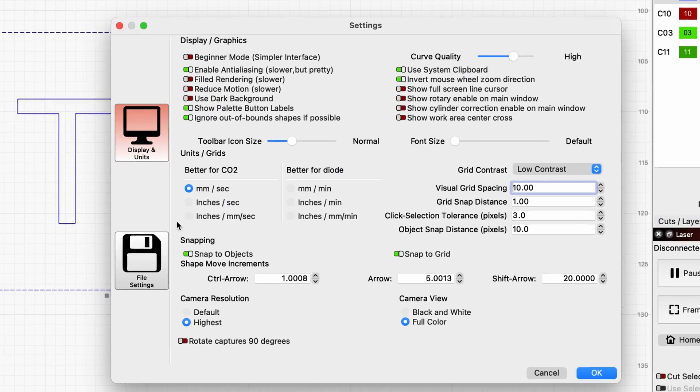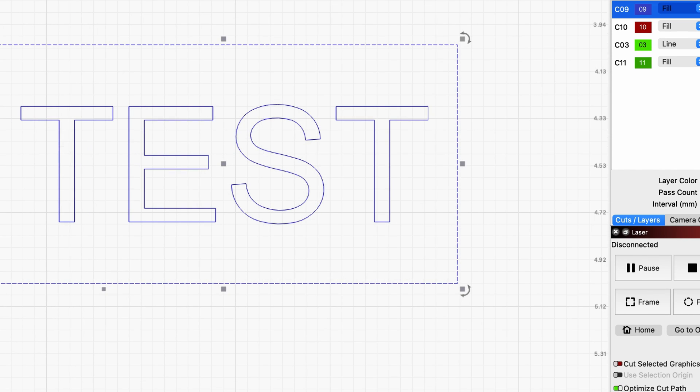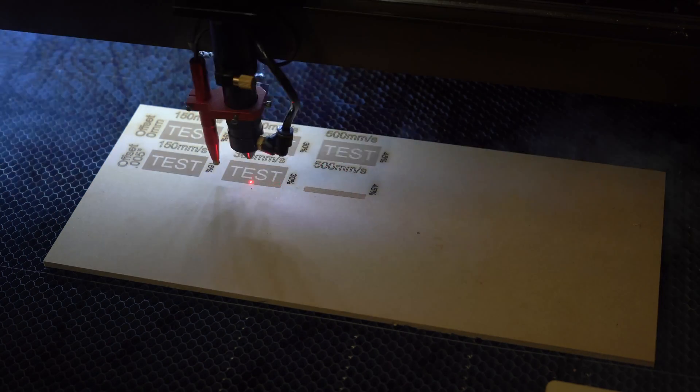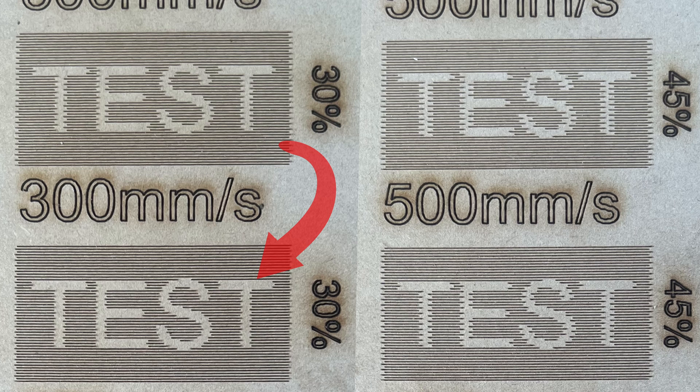We're trying to tell the laser to start or stop with better precision so we can make sure we hit our mark. Make sure you note whether your system is set up for imperial or metric and make incremental changes based on those settings. Since I'm already in imperial, I'm going to use that to make my adjustments — remember, you're going to be making very small adjustments. For my first change, I'm going to adjust all three speeds by entering an offset of 0.005 inches and then rerun the next set. You can see that each of the lines get much closer at the end, so we're getting closer.